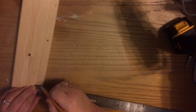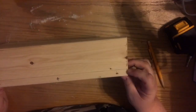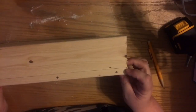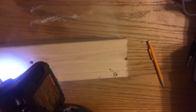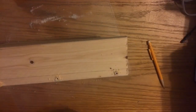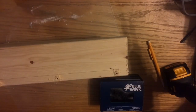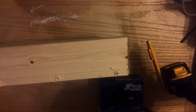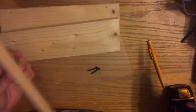I'm marking where I want the screws to go, then I'm pre-drilling using the extra board that's going to be the other side just to help stabilize the piece of wood. When I have all of the holes pre-drilled, we're going to go ahead and use screws. I didn't specify what kind of screws — these are actually sheetrock screws and they work fine because this isn't a project that's going to be holding a lot. You could also probably nail and glue, which is another video I think I'm going to do next.